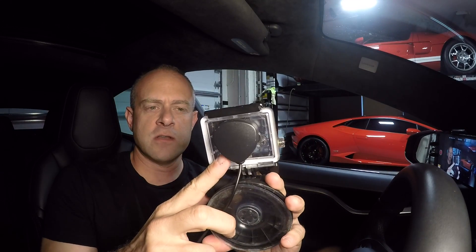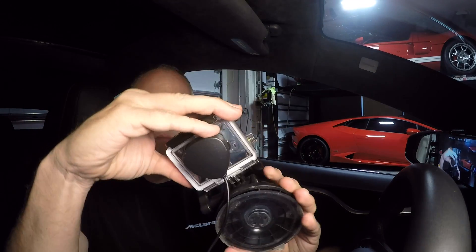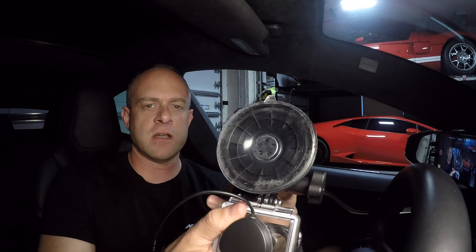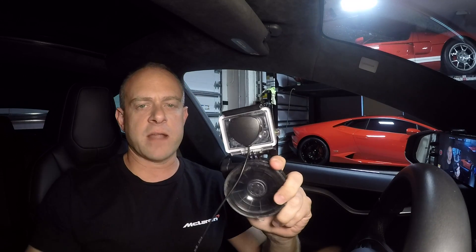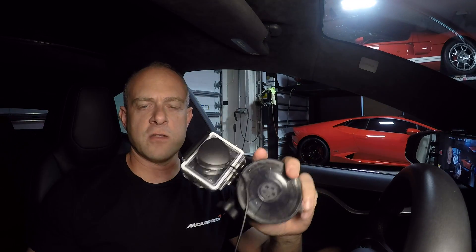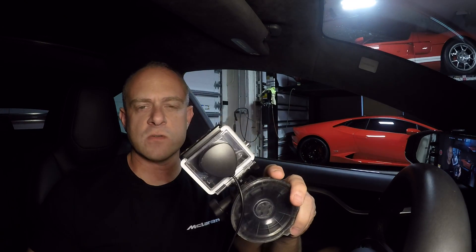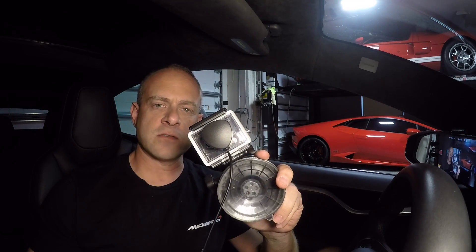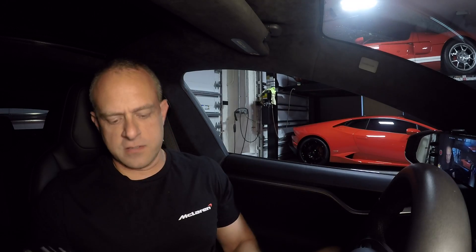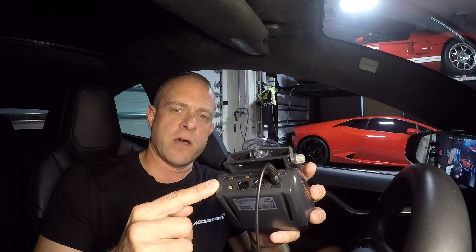I have one of those here. This device is $40, and I just stuck it to the back of an old GoPro suction cup mount. I take this and run it back to the rear windshield, which is not coated, and stick that back there for the runs. So if you're using the V-Box and getting some weird results or it says it's having trouble locating satellites, pick up one of these external mounts, mount it back there, and plug it into the slot right here.